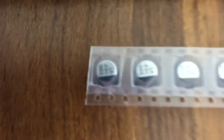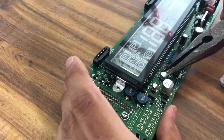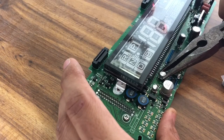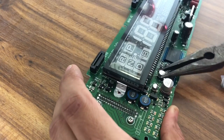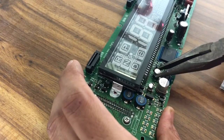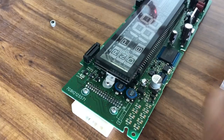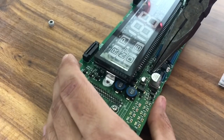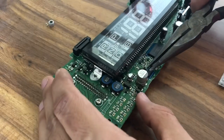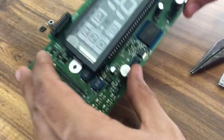We're going to replace it with a 220 microfarad 16-volt capacitor that I purchased online, which came in a set. Just take your needle nose pliers, twist the capacitor, and it will come right off. The plastic on the bottom of the capacitor will still be attached to the board, so you'll need to remove that too. I'll be soldering a new surface mount capacitor onto the board. I'm removing the remaining black plastic and cleaning up the location where the old capacitor was.